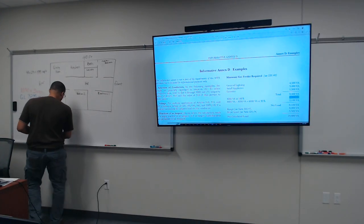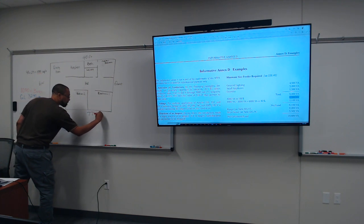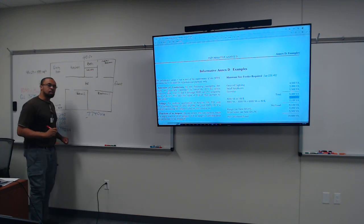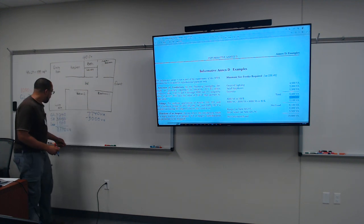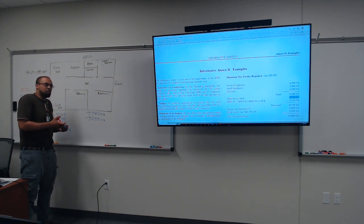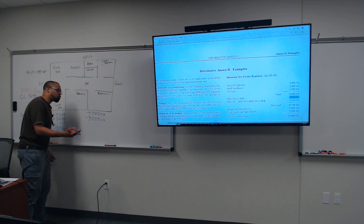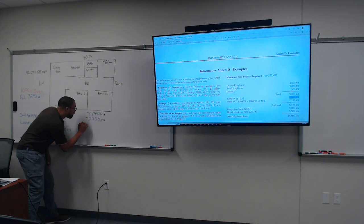So 7,740 VA, we're gonna minus the 100% of 3,000. This is the demand factor. We're not utilizing all of the 7,740. You're not gonna have all the lights on, all of the plugs. That's why the demand factor is placed in the NEC, because engineers know that the homeowner and the family are not gonna consume all of the electrical power at once. You're not gonna have your dryer and your oven and your microwave and your toaster and your coffee maker all up at one time, all right?